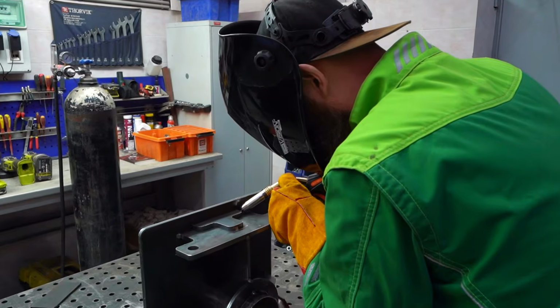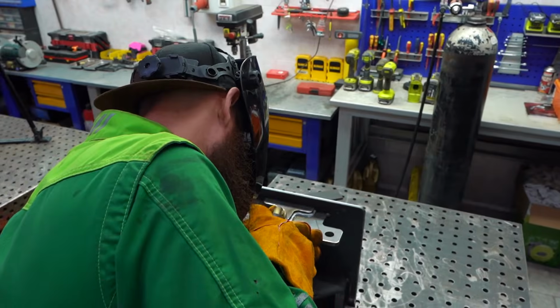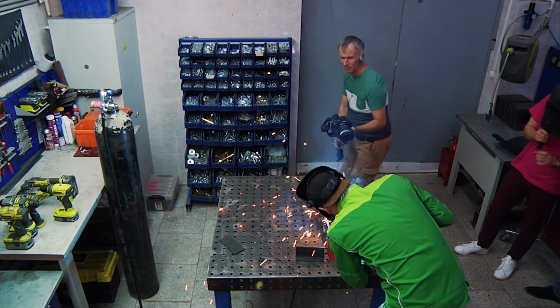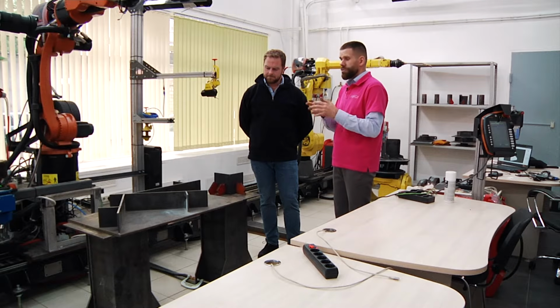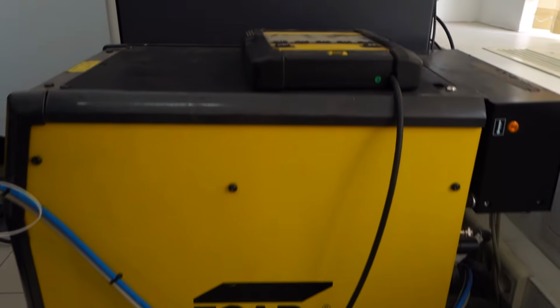If you remember, in our previous videos, Mike tried to weld several seams. And the seam did not have an ideal shape, right? Right. And this is the advantage of robots. But this requires some change in welding parameters, because when the robot moves, it requires a different speed of wire, different speed of gas, and so on. So this will require just some adjustment. And in order to describe it more, let us see how ABAGY software is integrated with welding machines and makes it possible to set up all of these parameters for the robots. Great.